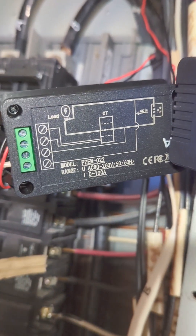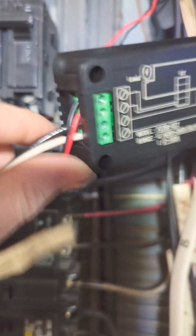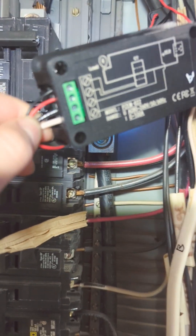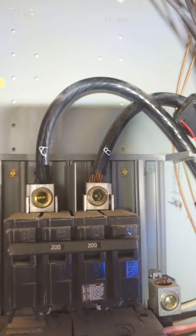Then you just need to wire up according to this diagram here. To simplify: your black and white wire will go into the bottom two slots — make sure the black is the third one in and the white is the last. Then your current transformer will go into the top two screws. Put your current transformers on the corresponding A and B.